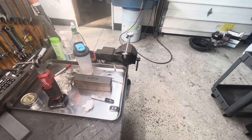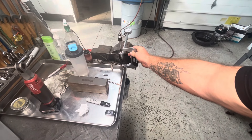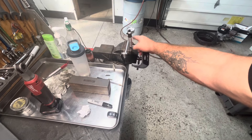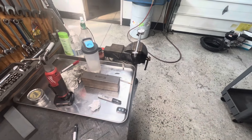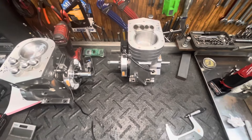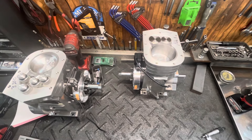I've got it clamped down into the vise, and then you just come in with your micrometers right here and screw this part in until it pushes the pin down and you get the dial down to zero. Once you get there, look at your micrometers — and that will tell you what size your bore is. That is the best, most accurate way to measure a bore.